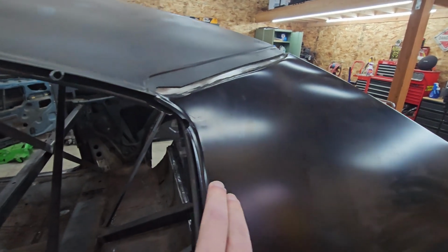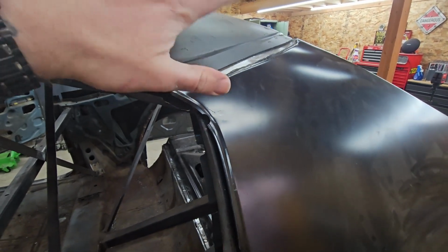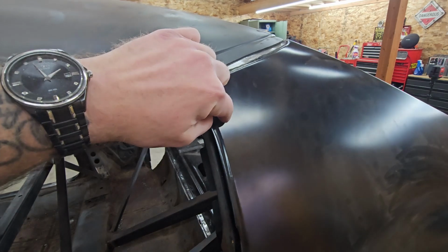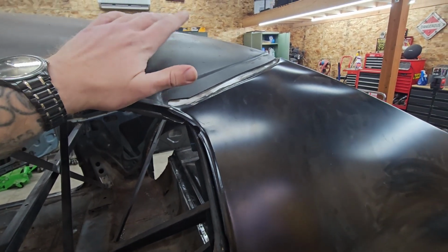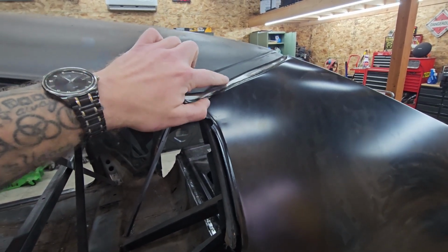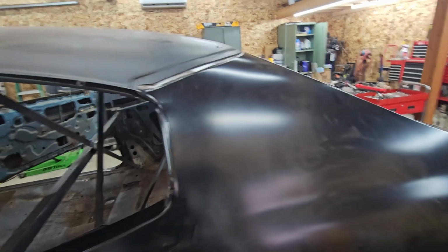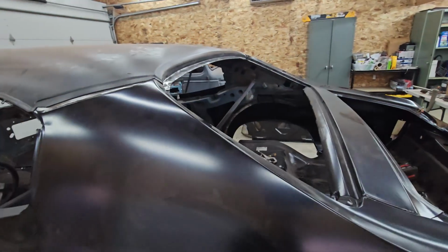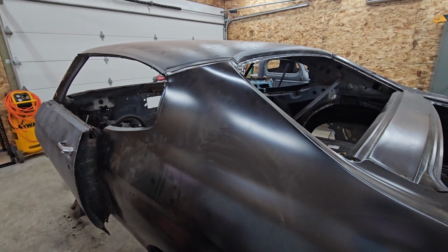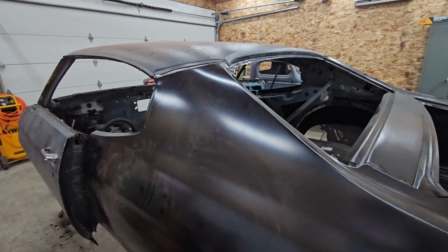Yeah, so the next video is going to be getting both sides attached here, cutting this, welding this down to the support. This is going to need filler anyways, but currently this sits high. I don't know if the roof was supposed to go on top of the quarter or not. I might have messed up. I might have not. I don't know. But I'm going to cut them anyways so that this and this sit flush together. And then I'm going to weld that to the inner structure so it's all one. Because before, when I took them off, they were spot welded to the inner structure. So they were attached to it, and I believe they're supposed to be. Either way, I'm going to do it, and then when I go to making this thing pretty, I'm going to have to make up all the extra work then, which is fine, right?